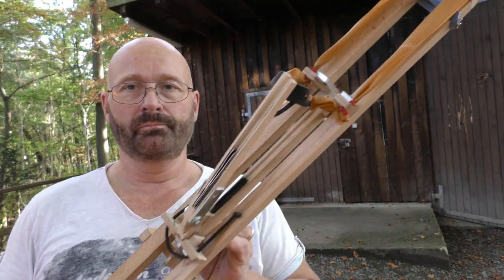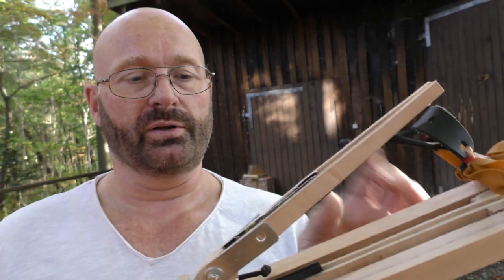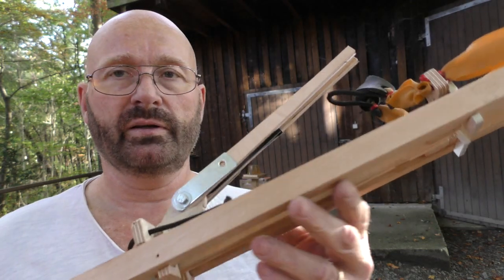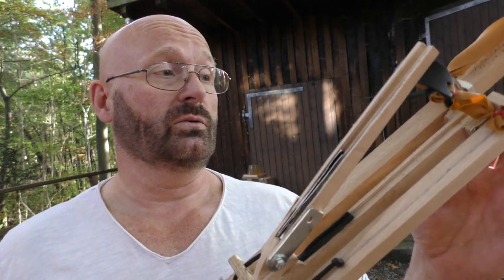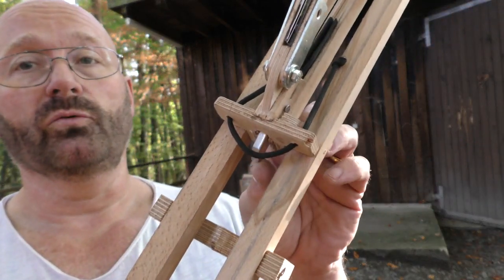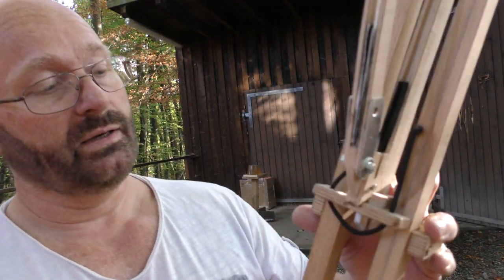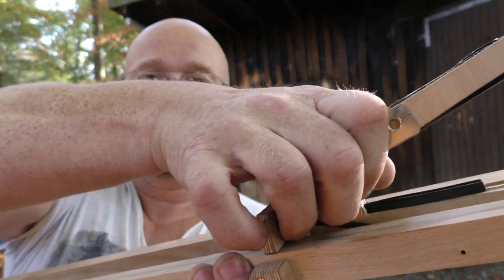So, as you see, this is basically the card shooting gun, but made from very, very thin wood. Actually, at some strategic points, I even used a little bit of metal to reinforce it. And of course, it has to be lighter because it has to be accelerated and decelerated. So we have to save mass where we can. It sits on rails, and the trigger of the main gun is this little aluminum piece here. And you see, this is the real trigger. So once the sled passes this real trigger, at this point the main shot will be released.